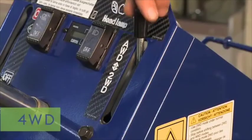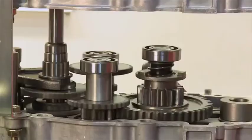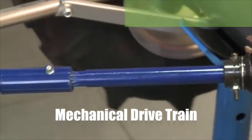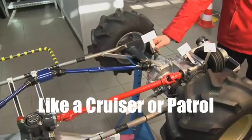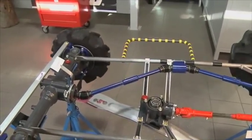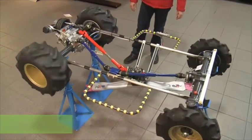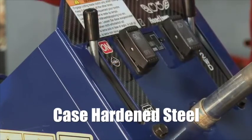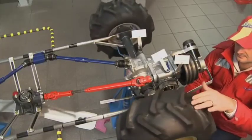The mower can also be driven in two wheel drive. The mechanical drive train resembles a Land Cruiser or Patrol, with drive shafts from the gearbox to the centre of the mower with universal joints through to the front axle. Flicking a lever on the dashboard engages a case-hardened steel mechanical diff lock, which works equally as well climbing or descending steep slopes in demanding situations.